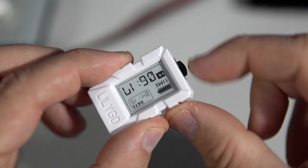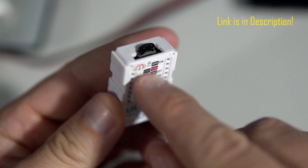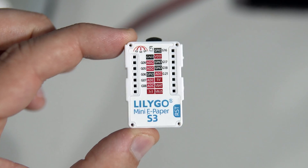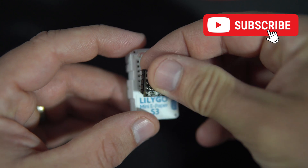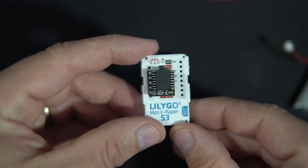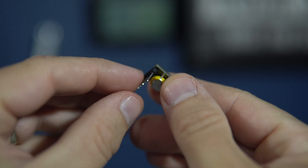The new mini ePaper S3 has a 3-way button as well as an SD card reader, but I don't need those right now. The only thing I need are these female headers. I will use them to connect the real time clock chip and the battery. The real time clock chip I am using is the tiny DS3231, which I found on AliExpress.